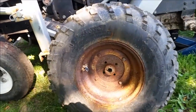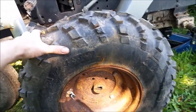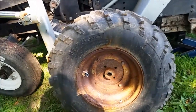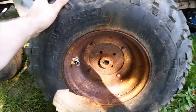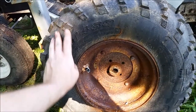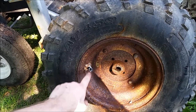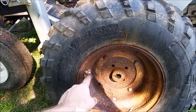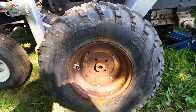As you can see this rim is pretty rusty. I filled them with basically salt water for weight because I was cheap and didn't want to buy washer fluid. This one developed a leak inside, so the tube leaked inside the tire and then started to seep out around where the valve stem comes out, and it's rusted the entire rim. It's probably rusted it inside as well.